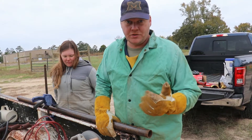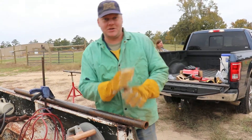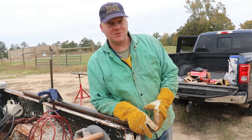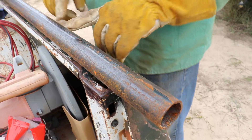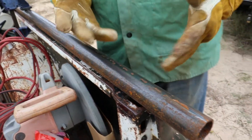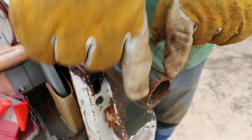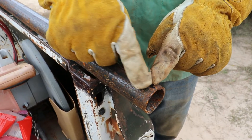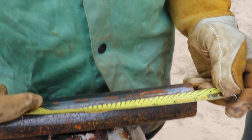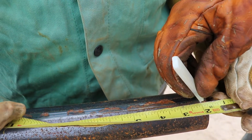Now we're going to mark it and get our little wing cope things created. One of the things you've got to make sure when you're doing these copings is that your little flange wing things are the same orientation on each end. The pipe does have a smooth ridge or colored line that goes all the way down it. Whenever I do my marking for the little wing things, I mark it right along that ridge and then make my cut inward. I'm coming in that quarter inch on either side — that should reach to the other inside bit on the other end of the pipe, which was the 66 and 3/8ths measurement. And because I'm burning an inch and three quarters, she's going to mark from the two-inch mark — it's just harder to see the little lines at the very end of the tape.